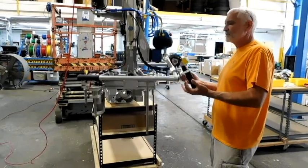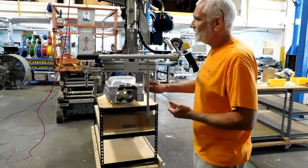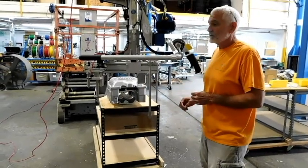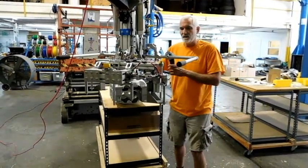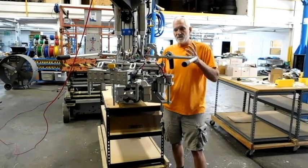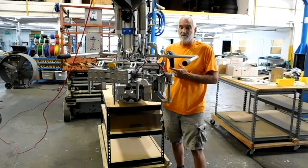The tooling uses indicators so that the gripper pads hit in the exact correct position needed to grip the supercharger. I'm going to turn it a little bit here and you'll see what the gripper process looks like. They'll extend in, and once they've come into the correct position, they'll extend upward, gripping the upper flange of the casting.